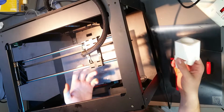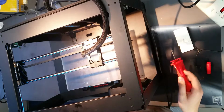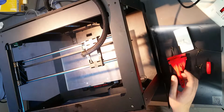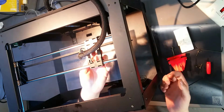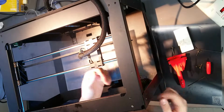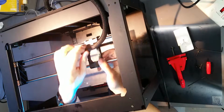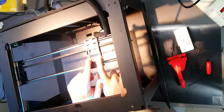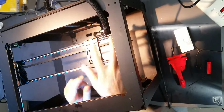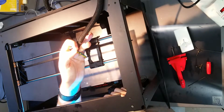Okay, so we're going to take a Replistruder like this guy, and we're going to put it on this Replicator 2 that's had its extruder removed. Once you've done that, you can do it the easy way and take it apart piece by piece. Just take it off. You should have a couple of screw holes here on the gantry, or the carriage, or whatever you want to call it. And you'll need the motor plug from the cords that normally go to the extruder.